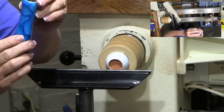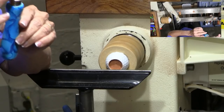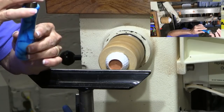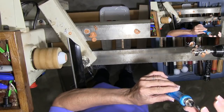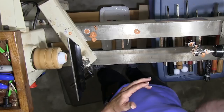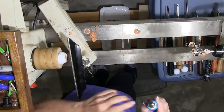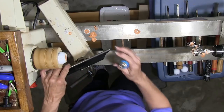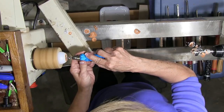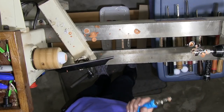This is a countersink drill bit put on a handle. I've put together a kit that has a handle a little bit smaller and a countersink drill bit — I use this as my depth gauge. You don't have to have this; you can just drill in and measure it. But I've set this so I drill it in about one inch, and I just turn it on and drill it to right there — no guessing of how far I went.